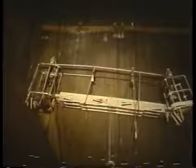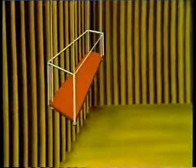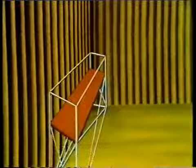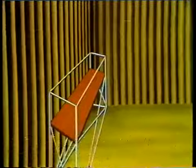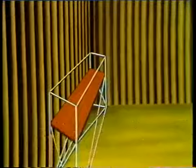A movable scaffold, like a spider, can be used for looking over most of the water wall. Fixed scaffolding can be erected inside the furnace to reach areas that need to be inspected. You probably won't use fixed scaffolding unless extensive work must be done on the water wall. Scaffolding can be hung from the furnace roof or built up from the bottom of the furnace. Fixed scaffolding provides a stable work platform, but it takes a long time to build.